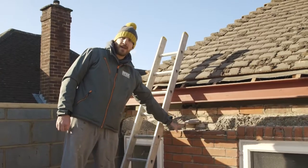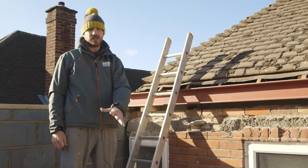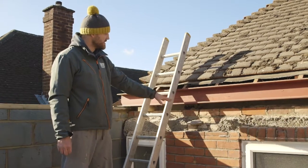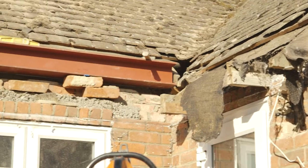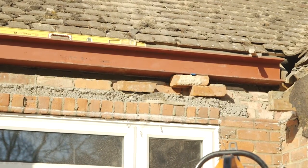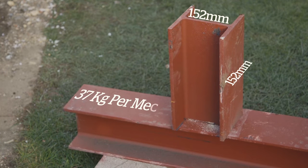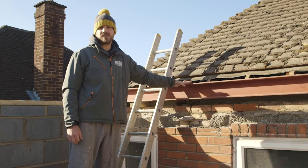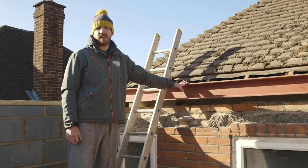This is one of the original walls at the back of the house which is coming out. This whole wall and windows will all be dropped, and obviously without this there's nothing supporting the roof. The structural engineers specified this steel, which is a 152x152x37 — 152 millimeters by 152 millimeters, and the number at the end is the kilos per meter, that's the strength and grade of the steel. In this case it's only 37 kilos a meter, which means we can lift it without any additional help.